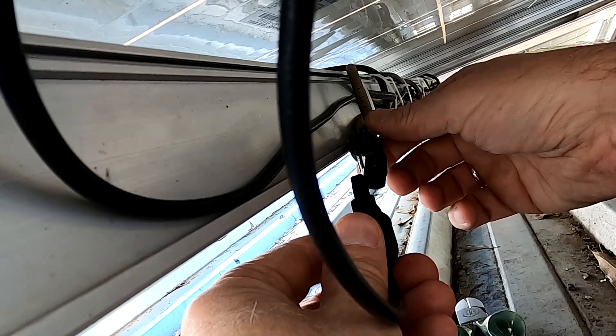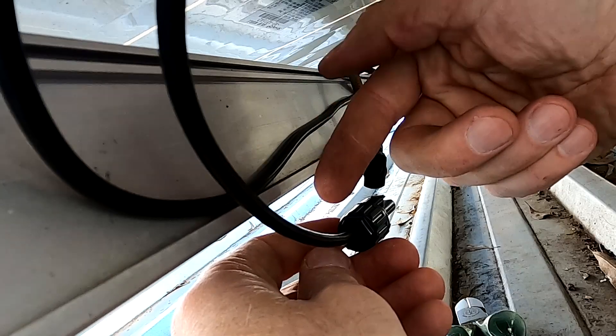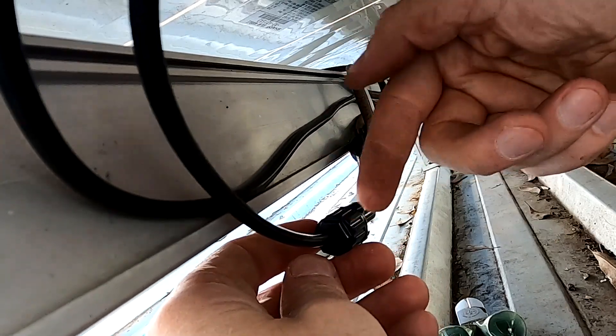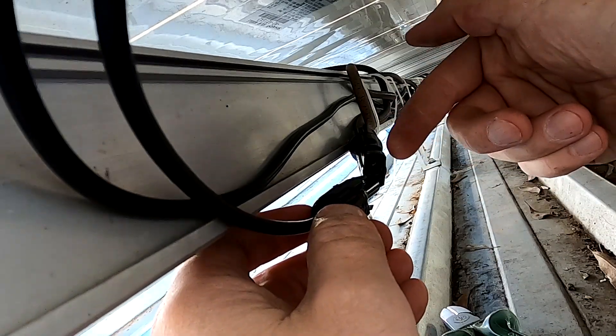This is the most negative connection from the solar string — I leave this disconnected until we have everything connected down in the garage. That's the final step, because otherwise you will have 150 volts DC on the cables, and you don't want to be working on 150 volt DC cables.